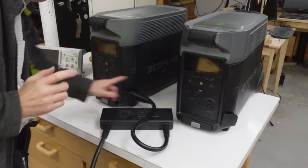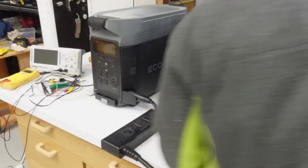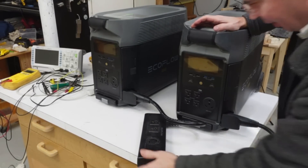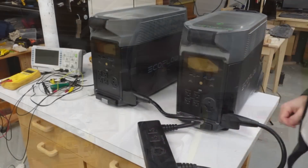What's interesting about these boxes is they're both 120 volts, but they can be connected together with this hub thing that plugs in on the sides with a really beefy connector, and that connects them in series and synchronizes them so you can get 240 volts out. They do make versions of these boxes for Europe where each box puts out 240 volts, so I'm not sure why they couldn't just make one box that can configure itself for 240 volts instead of using two. But this way you get two phases - split phase - which you wouldn't have with just 240 volts out of one box.